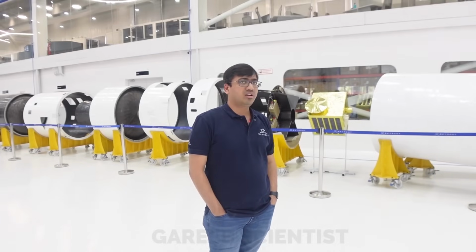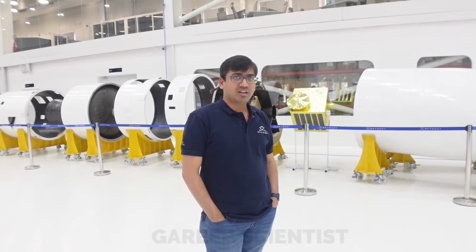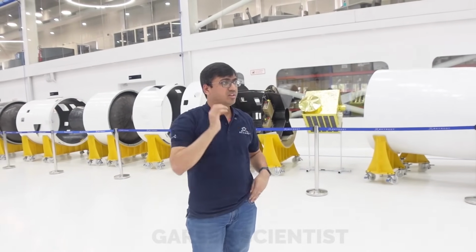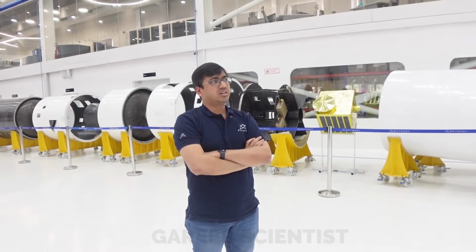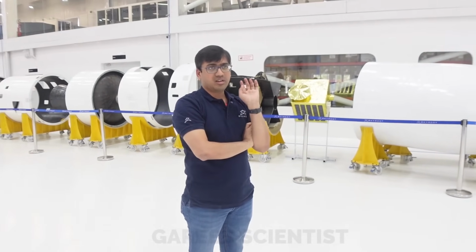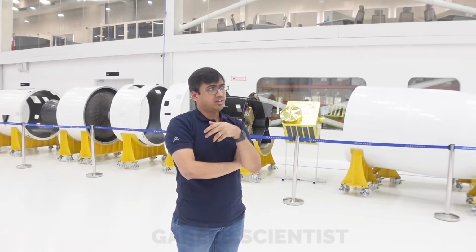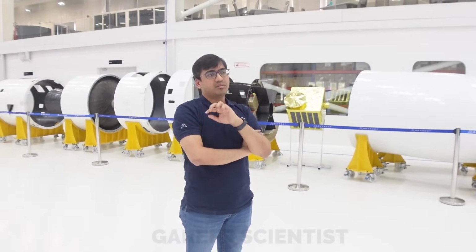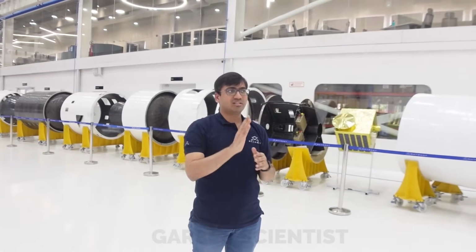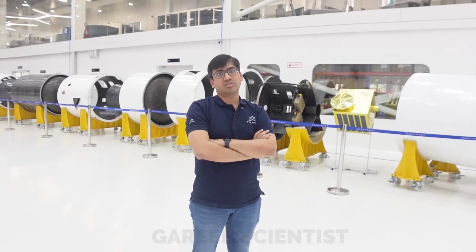Vikram S is a highly aerodynamics-driven vehicle, so we need to check the winds on that particular day. They have a wind profiler which checks exactly how the winds are, and based on that we feed the launch angle. Similarly here it will be slightly different, but the concept will be somewhat similar. With wind biasing, we get all the wind data, and based on that we record the program to the vehicle. The guidance takes it in open loop initially based on the winds, and then it goes to closed loop.